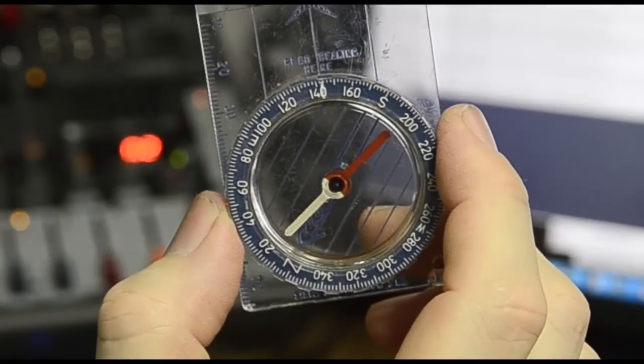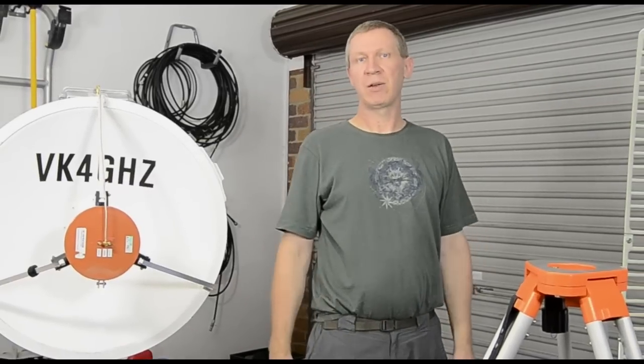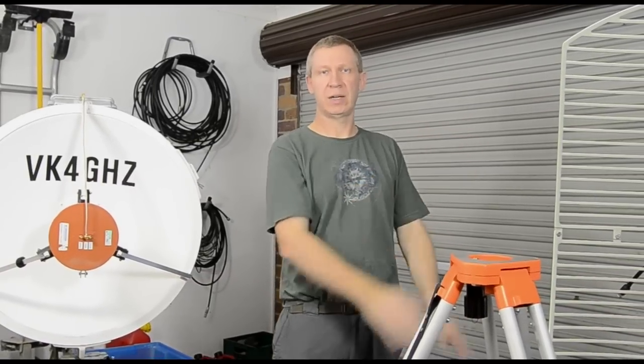Be aware these point-to-point calculations can give a bearing based on true north, so if you're out in the field and you're aligning your antennas with a magnetic compass, just factor in your magnetic offset. So using all these modern tools can make it really easy for you when you're out on site. You know exactly where you need to point and get a clear shot, even before you set anything up.